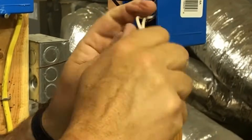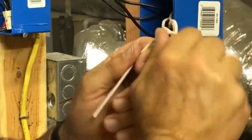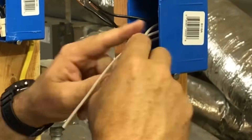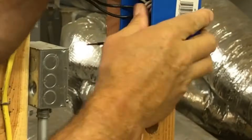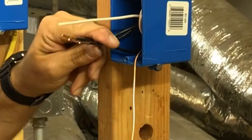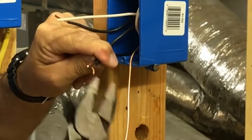A lot of people ask how tight to do the wire nut. You want it tight enough so the wires in your bundle start to twist with it — at that point it's tight enough and it's not going anywhere. We have our ground pigtail and now we're rolling in the neutral pigtail, and then the hot pigtail.